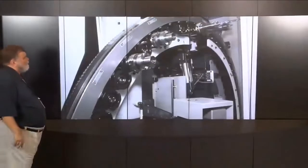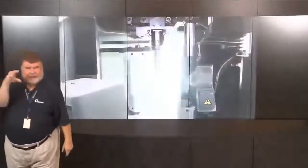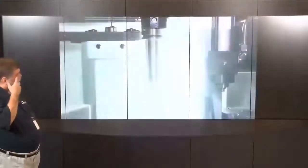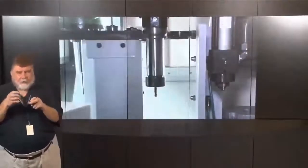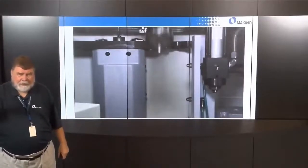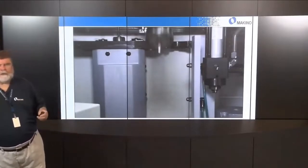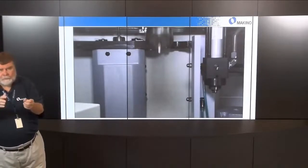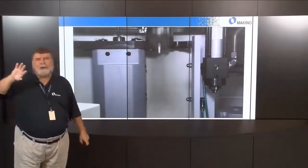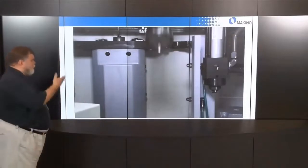This is actual video of the tool going down. You'll notice a flash — that's a digital camera taking an image of the tool as it goes into the work zone and as it comes back. We compare that digital image against the stored tool length, tool diameter, and H and D values in the control to ensure the tool hasn't pulled out, pushed in, or broken. We're assuring part quality in the tool magazine with no impact on cycle time.